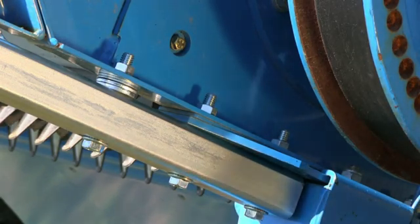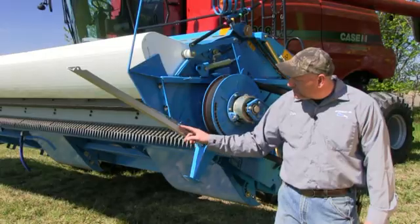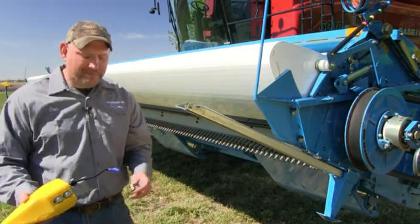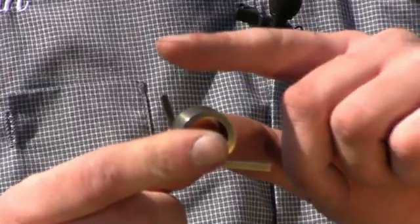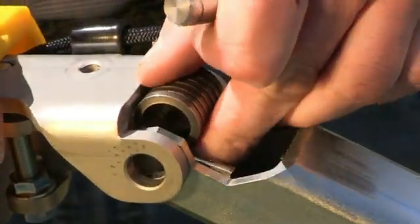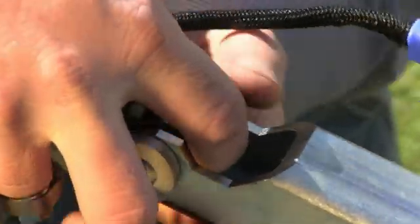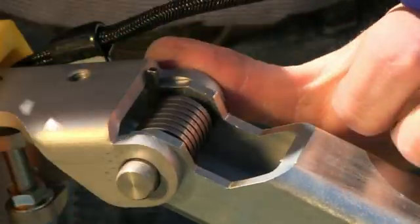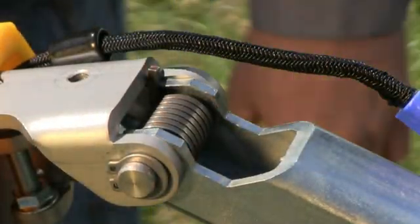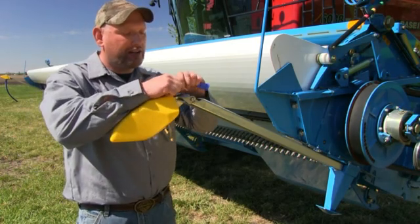You may have to drill out or enlarge this hole. Do not forget to put the three washers between the tube and the mainframe. Now we're going to install the sensor onto our bracket. It's very important that you put the short end of the spring up, the long end down against the tube. Then install the snap ring on the opposite side. Once that's done, put our leveling bolt in and an extra clamp up here.